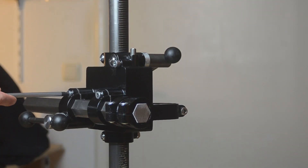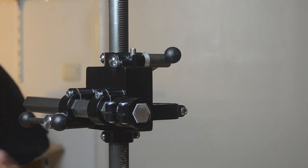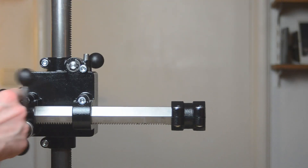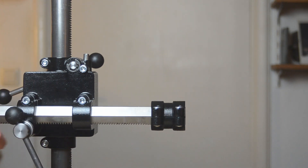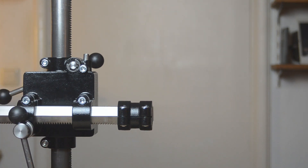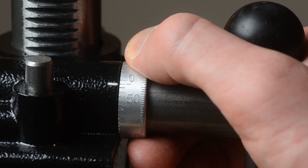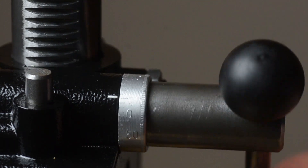It's advertised as a mill stand, and that is what I'm going to consider. It came nicely packaged — carton professional and solid. Assembly was alright, but fine adjustment of the eccentric in the guide housing was sloppy. Both eccentric screws were turned in the same direction, which caused jumping when lowering the machine carrier, like a plane suddenly sinking some meters because of an air gap.